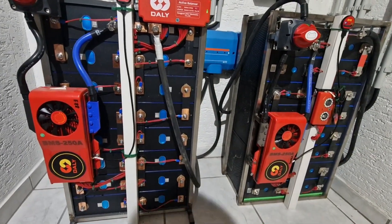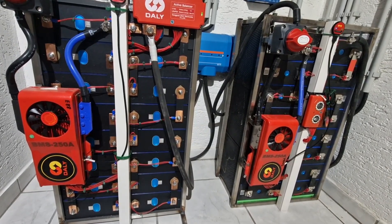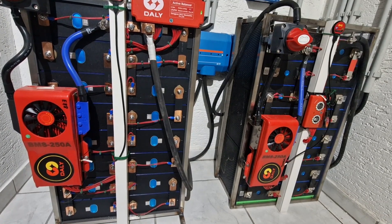I'd strongly recommend 3D printing to anyone building something like this — it creates something tangible with all possibilities. All components used are linked in the video description for interested viewers. This is a 250-ampere BMS with 16 cells, which means every one of the 16 cells has its own cable connected. The BMS measures individual cell voltages and can detect disparities or if one cell is too low. It identifies this and deactivates accordingly. All parts are linked in the video description if you're interested.